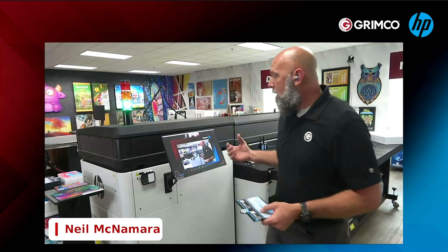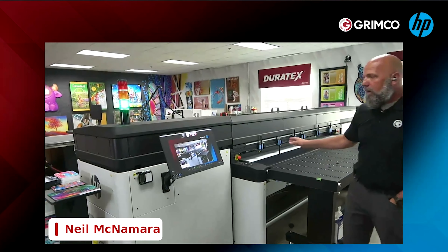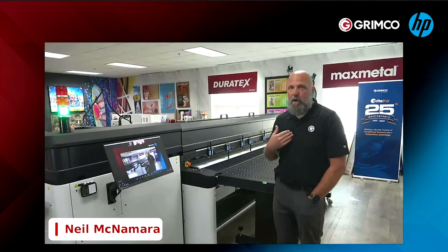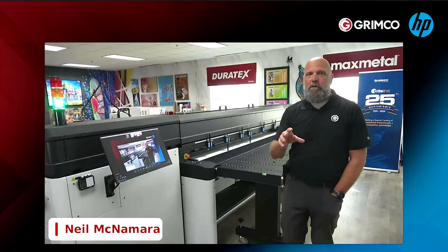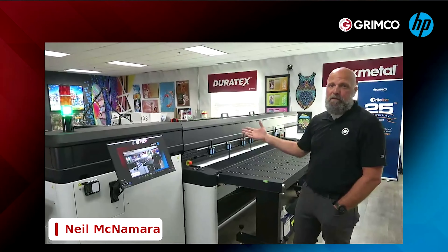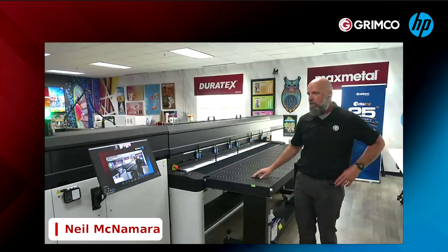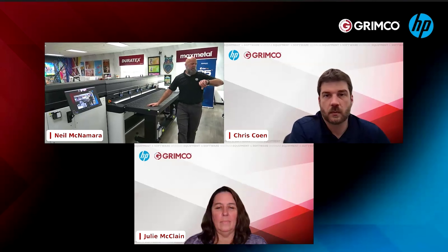This machine is a hybrid flatbed — kind of like the pizza oven at Costco. When boards run through the machine, minimizing time not printing is key. I'm running 24x18s, so it stops every 18 inches, drops the alignment bar, asks me to load a new sheet, positions, and begins printing. On a 4x8 sheet that workflow asks you to load sheets less often. The machine's about to start printing. The boards will draw through and make about three or four passes before it's ready for the next set.